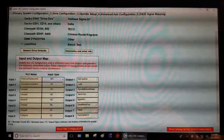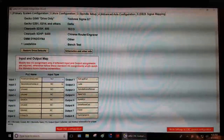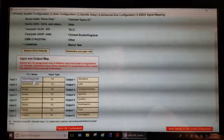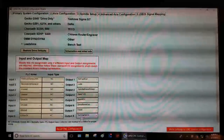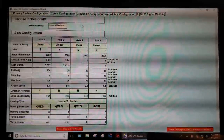I recommend that if you're new and just getting started, click on Leadshine and follow the wiring diagram. Go back to Leadshine, let it take all those defaults, and make sure what you have in the wiring diagram matches what's on your screen: input one first axis home, input two second axis home, input five drive okay, input eight e-stop, everything normally closed. For the outputs I'm not using any of them on my configuration, but I'll leave the defaults — it doesn't hurt anything.